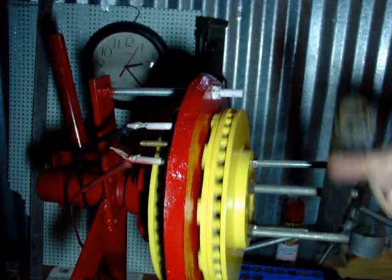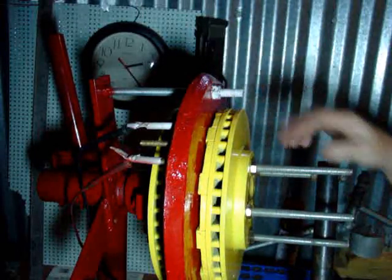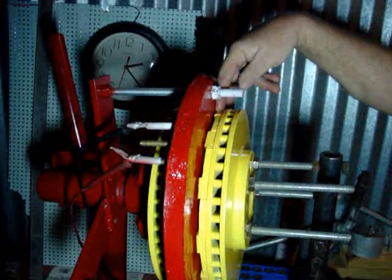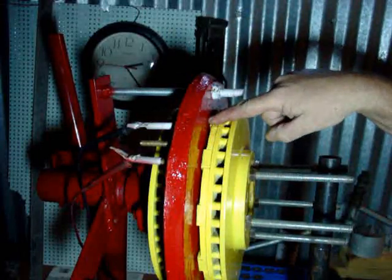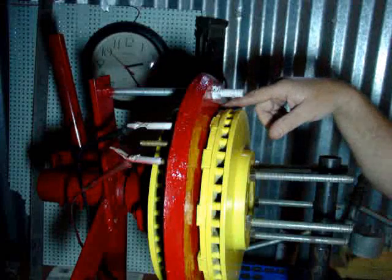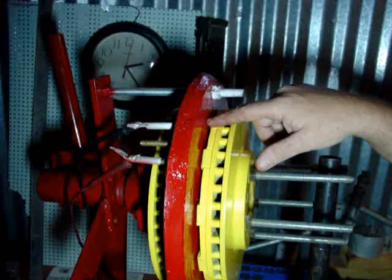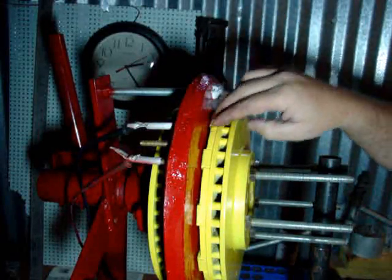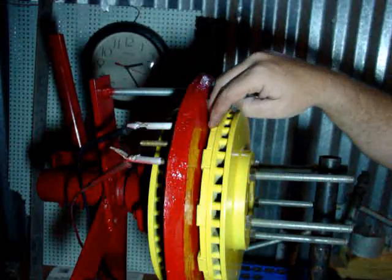This is 12 magnet positions — one through twelve. I can feel them, you can actually see it. Six of these magnets are south, six are north. I've got one coil right here and one coil right here. I've got two magnets — a north and a south — and the coil right here. This magnet is leaving this phase and it's a south magnet; this magnet is entering this phase and it's a north magnet. You're not generating anything when your magnet is dead center of the coil — that's maximum flux. You only generate when the flux changes.